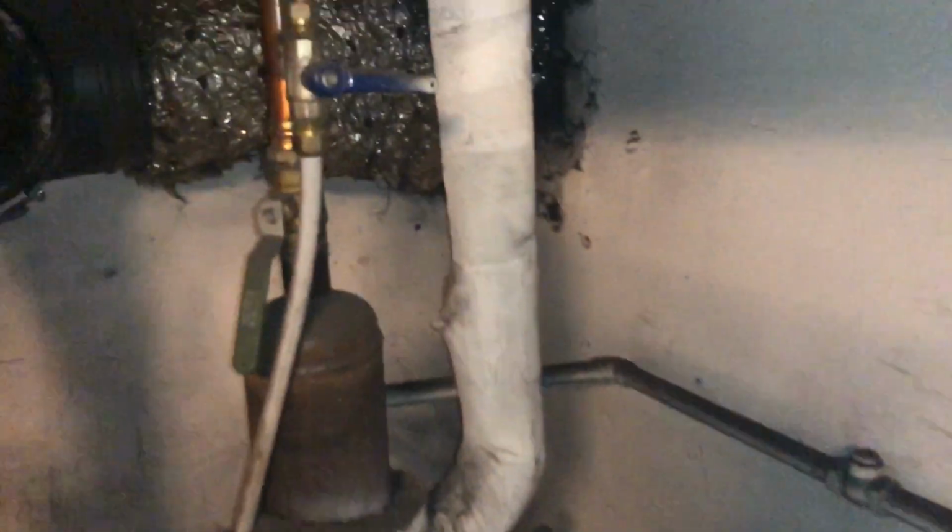I've got to put in a system here as a loop system. We've got an open vent up in the top, this pipe comes down. If you fill the system, it runs straight down the drain, and our antifreeze goes straight down the drain. Well, that's really bad. So what I'm going to do is put in two tanks here, and I've got a fill loop here with this pipe, and I'm going to do an open vented but a recirculation system, so I can fill it up with the new antifreeze.